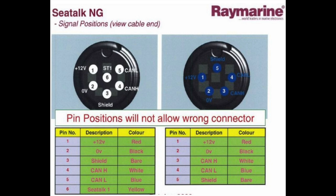Just a moment ago I mentioned NMEA 2000 as a standard. Well, one manufacturer has decided to make a slight amendment to that standard with SeaTalk-NG. This does use the NMEA 2000 protocol, however the connector is slightly improved. They've changed the pin layout slightly so the connector cannot be inserted the wrong way. I also noticed that in the middle of this connector there's an extra pin for SeaTalk 1 — the plot thickens.